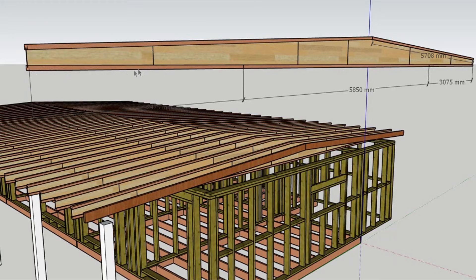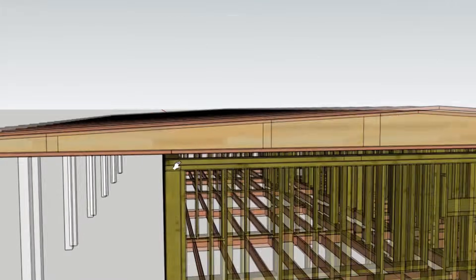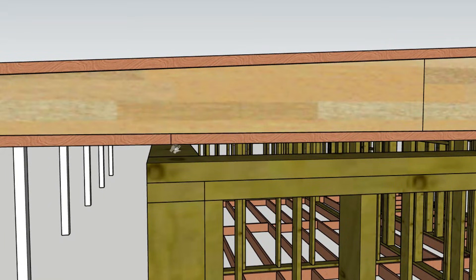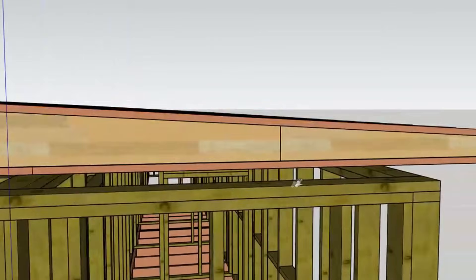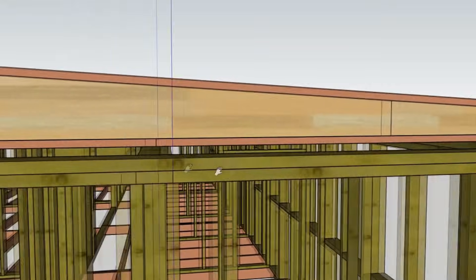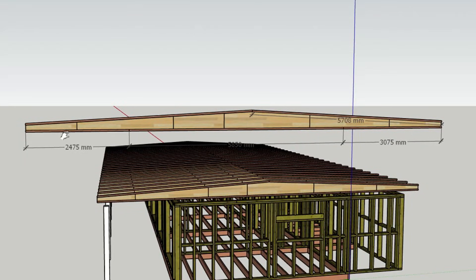As can be seen from the drawing, both the beams and plywood, for obvious reasons, are not single pieces but made up of several elements. For the beams, at the top these are two beams 5.7 meters long, joined at the ridge. At the bottom, these are three beams with lengths of 2.47 meters, 5.85 meters, and 3.07 meters. These dimensions are selected so that the beam joint points fall on the top frame of the house. The beams were joined with the same plywood, glued and screwed, using Brit wood glue PVA D4.